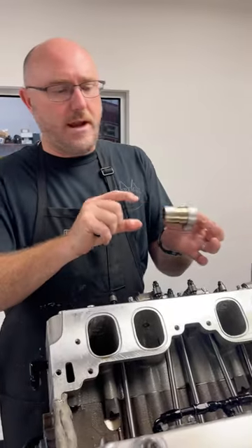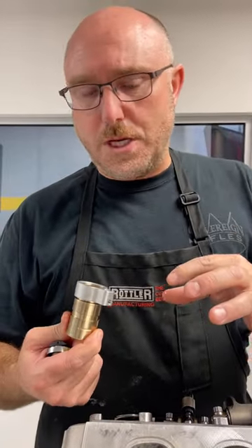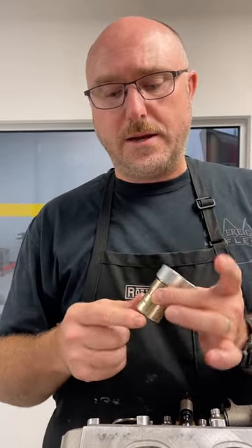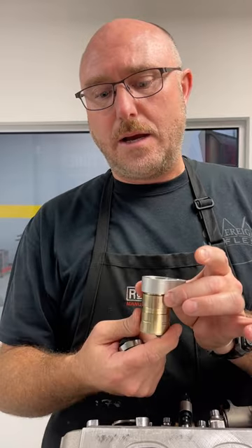Basically what you have is a bronze or brass bushing here. The block is machined for an exact fit — this is about 0.312 inches and the block is about 0.313 inches, it's a very precise fit in there. Then there's a collar that's threaded on, and we can thread the bushing in or out to set the height we want for the bushing, and then it's got a set screw that locks the collar — sometimes you call the collar the wedding ring.